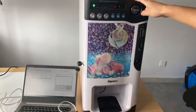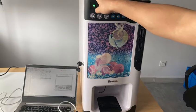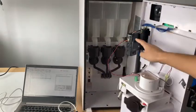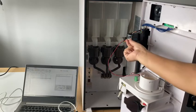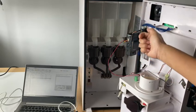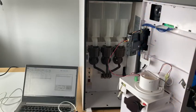This is a simple vending machine. Normally for this type of coffee vending machine, there is already installed a simple Pulse interface coin acceptor. For this coin acceptor, just three wires are needed: two wires for the DC 12V power supply and one wire for the pulse signal.